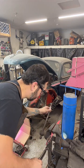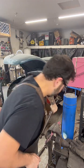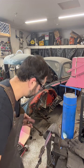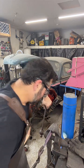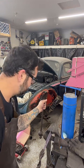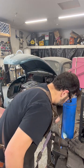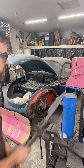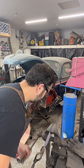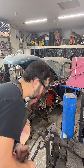This is something I learned from Jason Knight, because the way the jaws are shaped, it won't affect or dig into your bevels. Just when you're doing it, don't hold on to the tang because you'll start to warp it back and forth. Nice and straight. And you don't have to go crazy with the pressure.